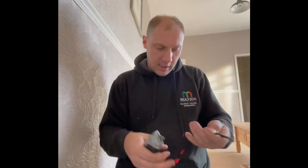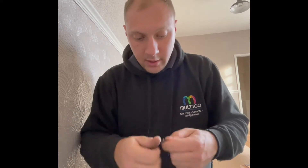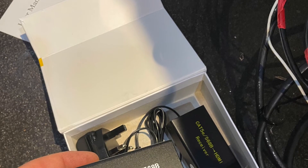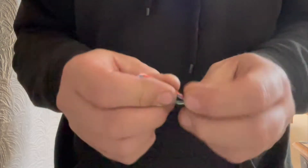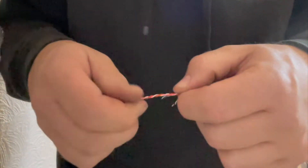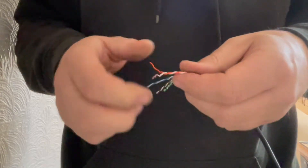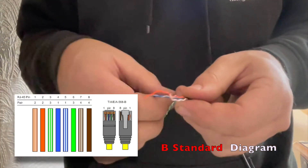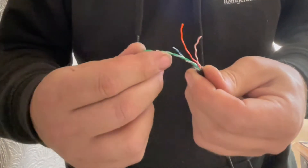We're making up a couple of RJ45s. This is going to be for the HDMI link downstairs for the screen inside the bar. What we've decided to do — when we pulled cables in the other day, we installed a twin Cat5 cable. We're going to use an HDMI sender over Cat5 to send the signal from upstairs down to behind the bar, so hopefully it should work. We're just going to quickly make off these two ends.